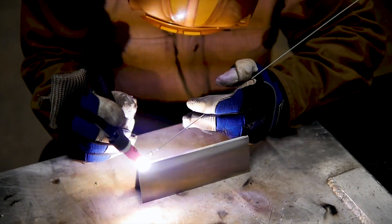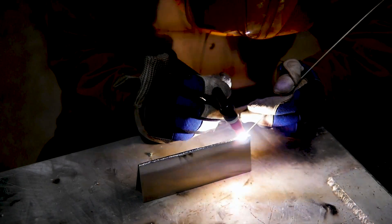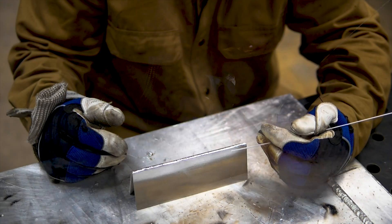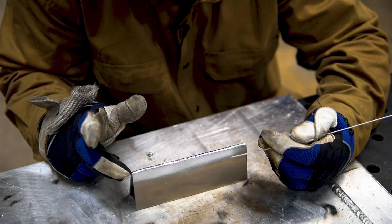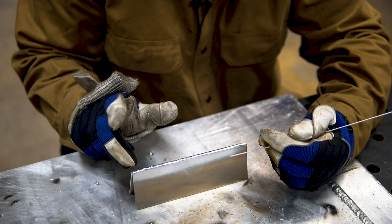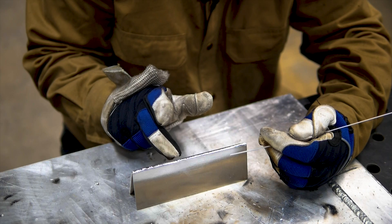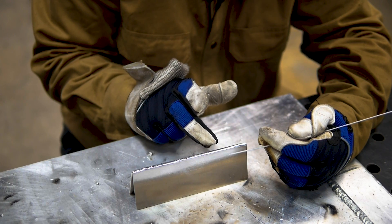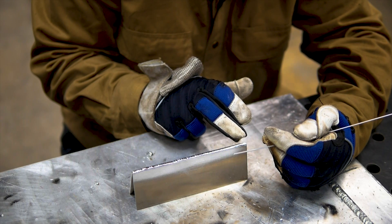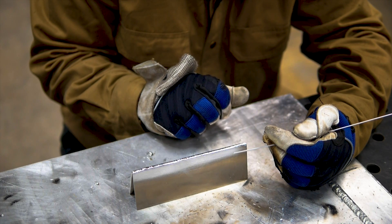The setup we were using today was a 1/16" 4043 filler rod and a 1/16" 2% lanthanated tungsten with 100% argon. As you can see, I bit into that corner just a little bit more than I wanted to — could have made that a little cleaner. I dipped my filler metal maybe once an inch or so and just pushed that puddle along. You don't want a lot of buildup; keep it clean. At the end I tapered down my amperage quite a lot — I was almost barely on the foot pedal — just to give it that nice clean cap at the end.